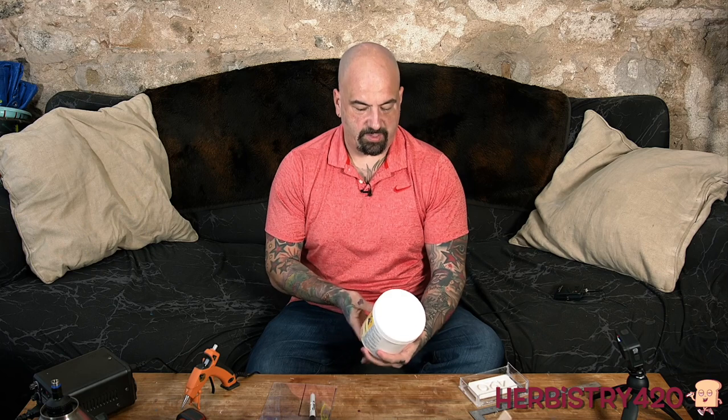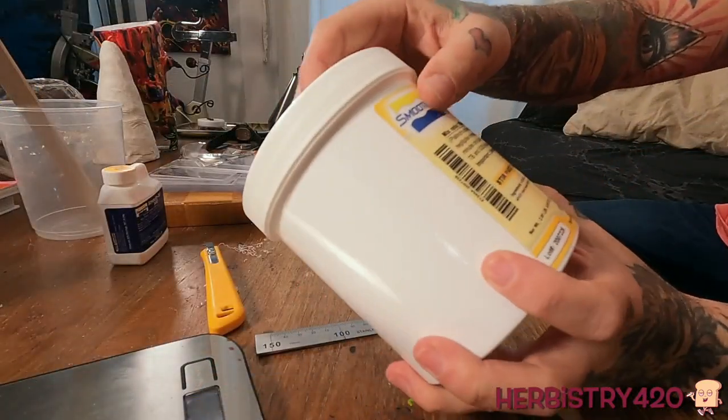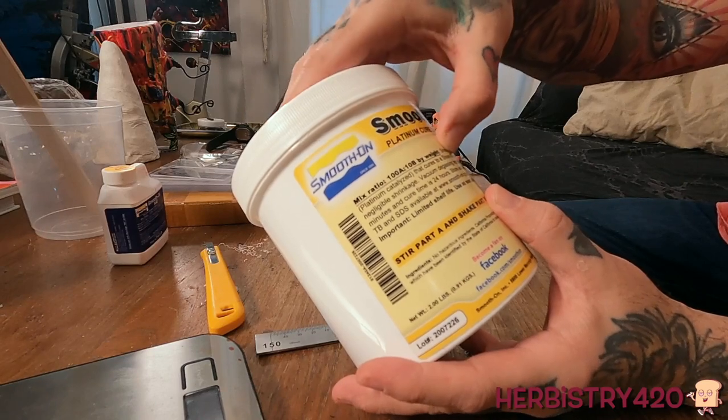So what kind of silicone are we using? We're using silicone from Smooth-On — I'm not sponsored by these guys; in fact it's a bit expensive. But they make amazing casting resin, casting plaster, all kinds of cool stuff — check out their website, I'll leave a link. Smooth-Syl 940 is a food-grade silicone. You need to use food-grade if you're going to use this for candy or chocolate or anything you'll eat. If you don't, the silicone will have impurities that get picked up by the chocolate or candy and when you ingest it, it will be bad for you — dangerous. So use food grade. This is food grade, and it's a 10-to-1 mix ratio: 100A to 10B by weight.